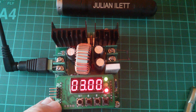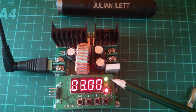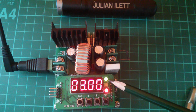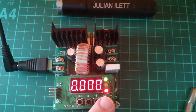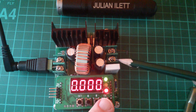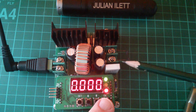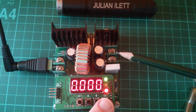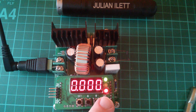What will happen now if I switch on the output? Well, what we're monitoring here is volts, and we have the full 3 volts. The green light has come on, and that's CV — constant voltage. So it's now in voltage regulation. How many amps do we have? Zero, of course, because the piece of wire is burned out. There's nothing linking the two output terminals; it's an infinitely high resistance. No current is flowing — zero current. So it's now in full voltage regulation: three volts, zero amps.